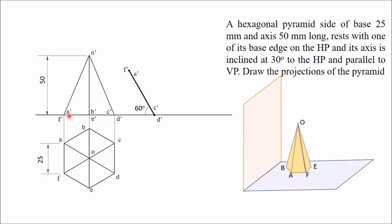To find O', take F' and D' as centers with arc length equal to O'D' and draw two arcs. The intersection of these two arcs gives the point O'. Join O' with F' and O' with D' to draw those two sides. Then measure the center point of the base line, mark that point, and join it with O'. In this way you have completed the front view of the tilted pyramid, with the axis making 30 degrees with the HP.